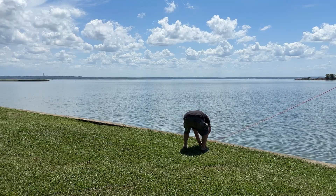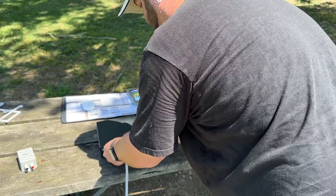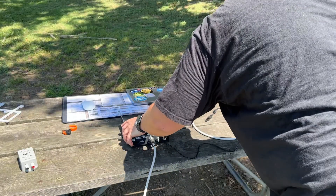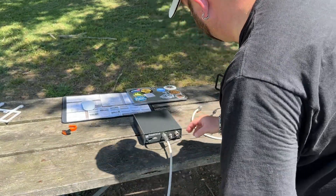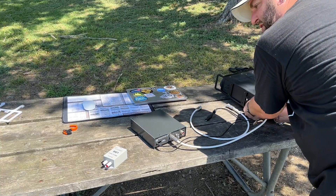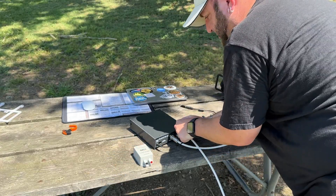How about this view, huh? So now all we have to do is the finishing touches. We need a good tuner in line — your tuner inside your radio is probably not going to cut it. This is the MFJ-939, great tuner. We want to use fairly short runs of coax — three feet or less is ideal to connect the radio to the tuner to the balun. You can save 10% off Messi and Paoloni coaxial cable at Messi.it using code K8MRD — you get free shipping over 99 euro to the US and Canada — or at Gigaparts using code MP10.